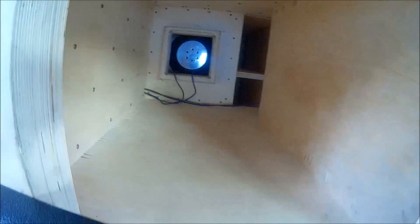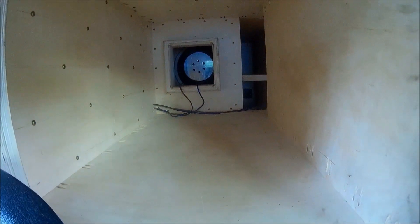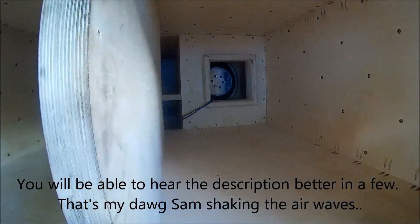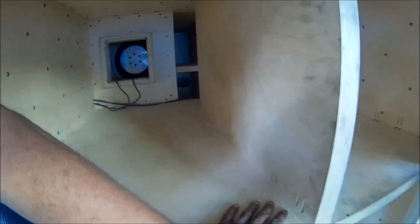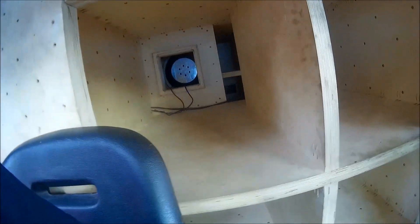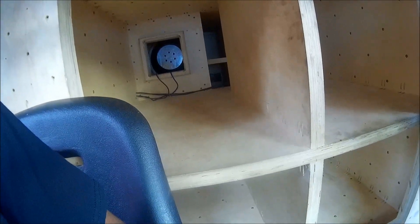It's a parallel-tuned 8th order bandpass. It's essentially a parallel-tuned 6th order firing into a big chamber. I did separate chambers for the big chamber because we needed to tune it high. The bigger the chamber you go, the harder it is to tune high. All this accomplished that we lost a little gain, but we were able to tune probably 10 to 12 hertz higher.